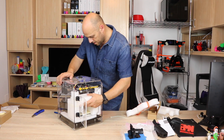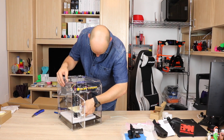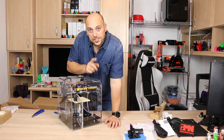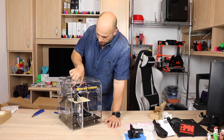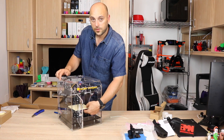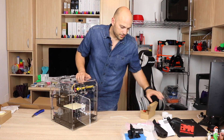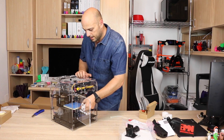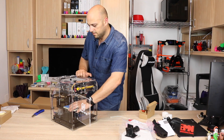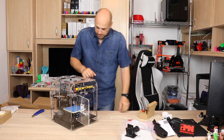This is interesting because this printer does not have lead screws — it has belts for the X, belts for the Y, and also belts for the Z. Very interesting approach. It is not a heated bed, and it also feels like silicone. Let me check if it's also magnetic — no, it's not magnetic. But it kind of sticks on well because it's like two elastic or rubber parts which kind of suction together. I'm happy with that.